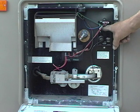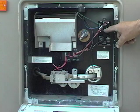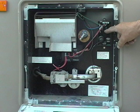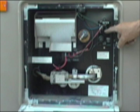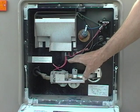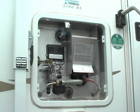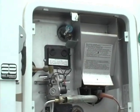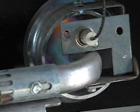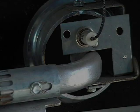There's a little brain box or module in your water heater that controls everything. It also has a protection device called an ECO, or emergency cutout switch, that will shut down the system if everything is not right. Most systems have what is called a one-try board — after one unsuccessful attempt at lighting the water heater, it goes into standby mode and turns the light back on. You have to shut the switch off and then on again. If there's air in the lines, you might have to do this a few times. These water heaters have safety devices, but they're not as restrictive as the manual type — if the water heater gets too hot it will shut down, but after it cools down you'll be able to relight it.